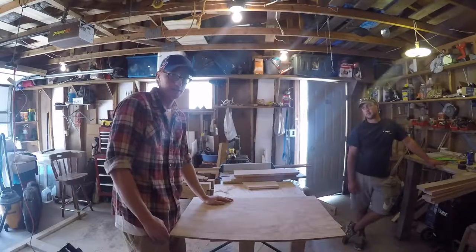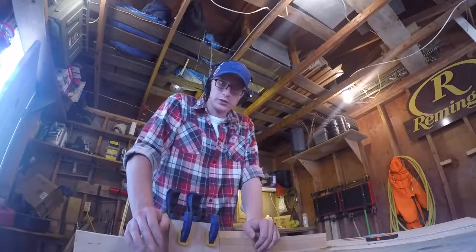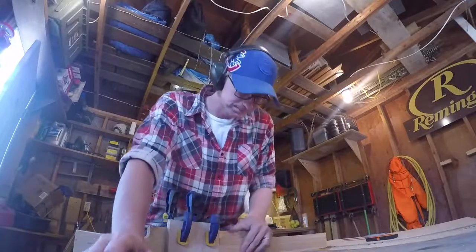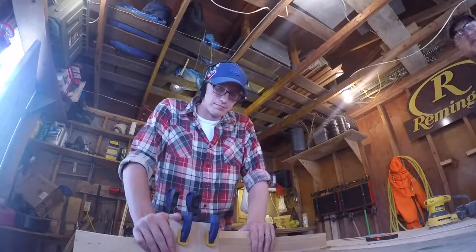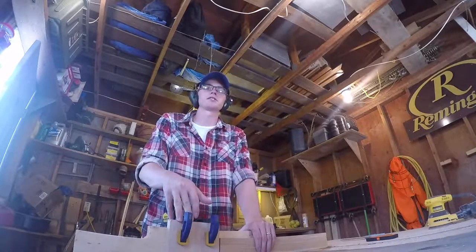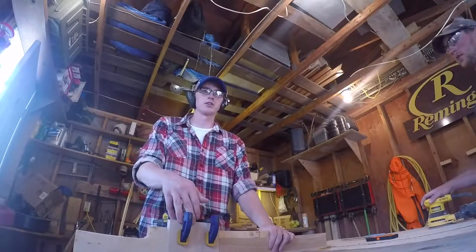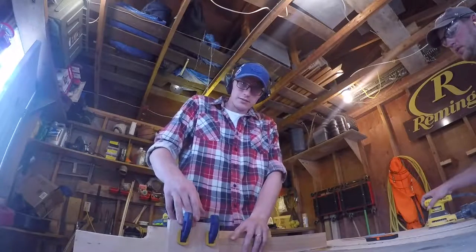There's more grindy work ahead. I've got the table saw sled set up for cutting the shoulders out of the slats — just a half-inch notch out of the corners. It's super simple: if you've got a sled, just plant the stop block and go to town. But it's going to take a while because we have to make four cuts for every single piece of wood, and there are 27 boards total.